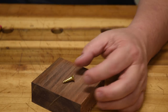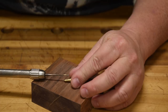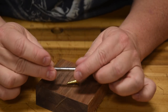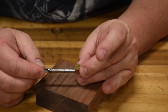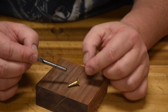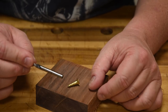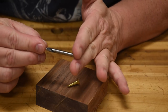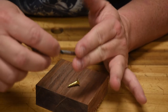So you're going to need two drill bits. I'm going to use a push drill for the center section - just an old Miller Falls style. And I'm going to be using a 3/16th drill bit for this number 8. These are basically all sized for specific drill bits. A lot of times I'm putting the screw in after the fact, adding a mechanical backup to a glue joint. For example, when I did those drawers, I had a rabbet - I put a butt joint into the rabbet so it didn't show up front. I glued it all up and after it was glued up, I put the screw in.